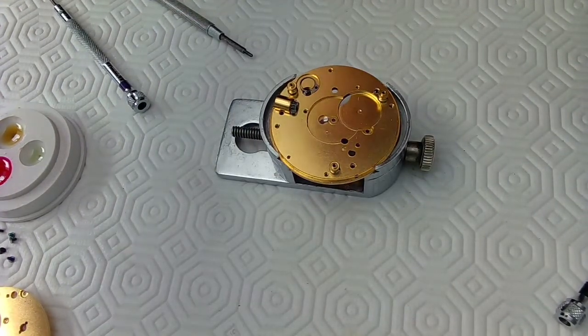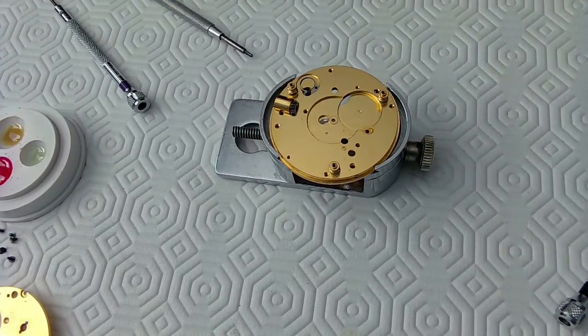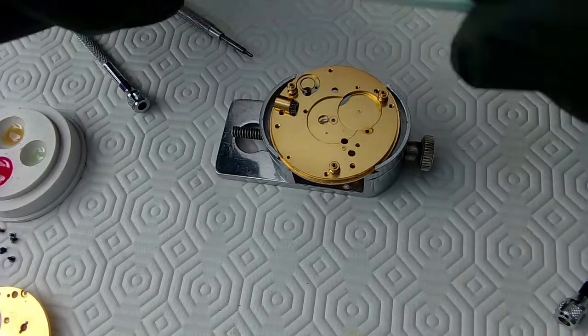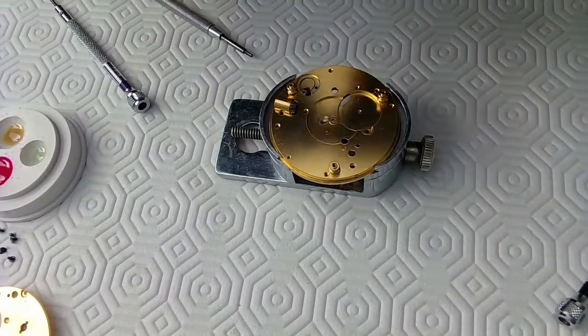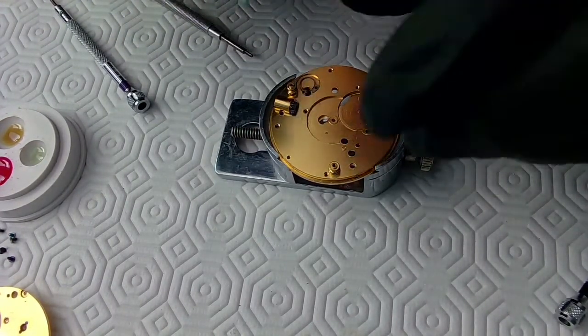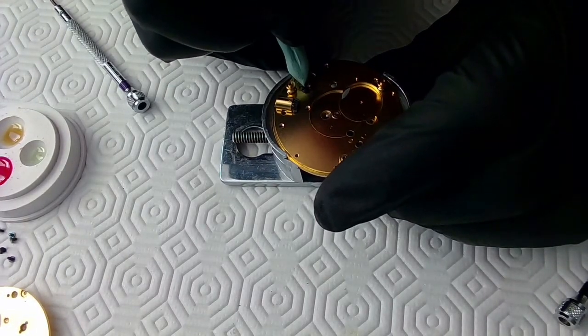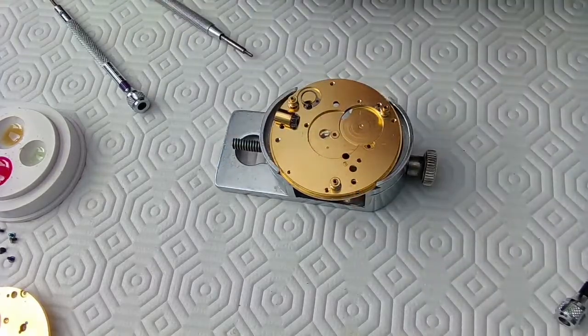I've got a piece of Rodico right here, fellas. It's the world's biggest piece of Rodico. Why do I have a giant piece of Rodico here? I don't know. Somebody said Rodico leaves smudge marks. I was like, not the stuff I got. My Rodico is perfect. And you pull the Rodico apart and then fold it over, and then it shows you a clean surface. And I got a little tiny bit of oil right here that I'll just jab with the Rodico. That'll pick that up. So there we go.